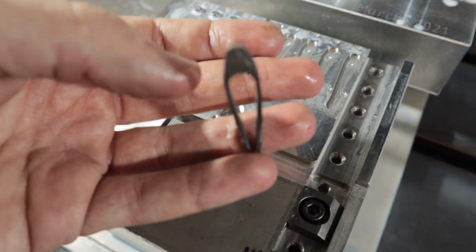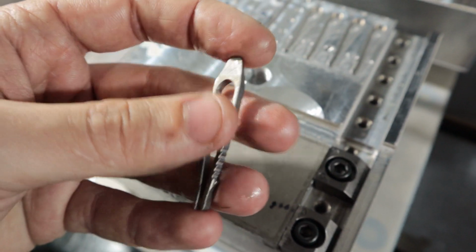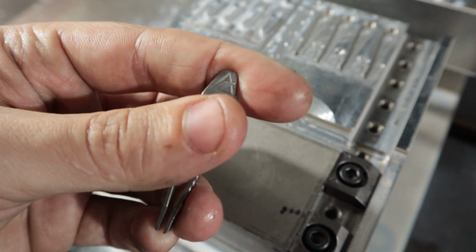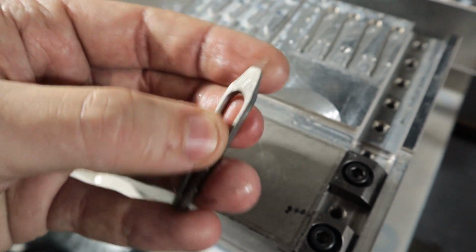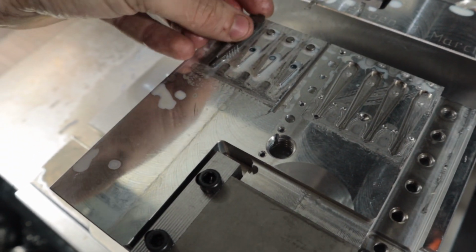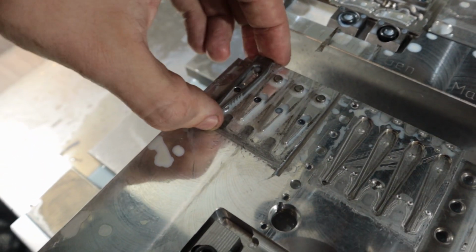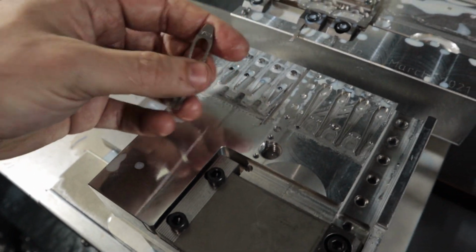I will say I would like to get a bigger backside chamfer, because the one that's on here doesn't produce a big enough chamfer, and I still find myself having to deburr at least one of these sides. I'm doing that because the screw is in the way for op 2, and you can't run a chamfer mill in the center. So that's the fixture for the tweezers.